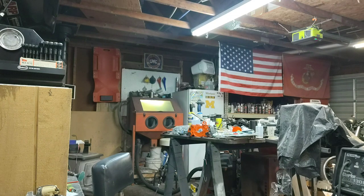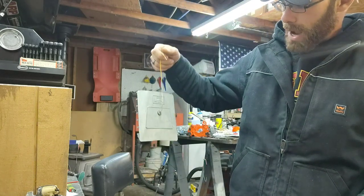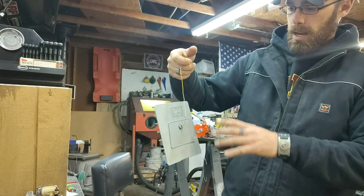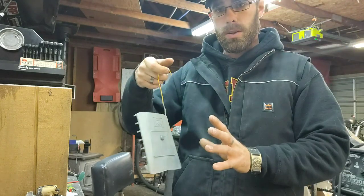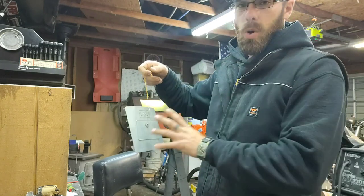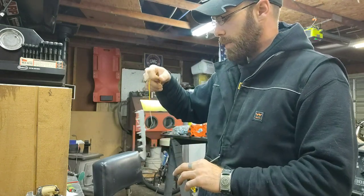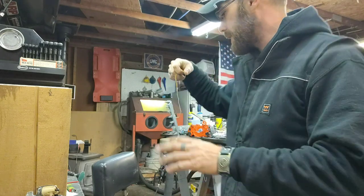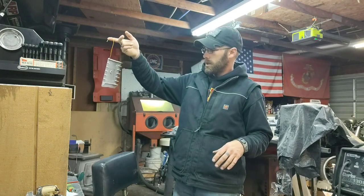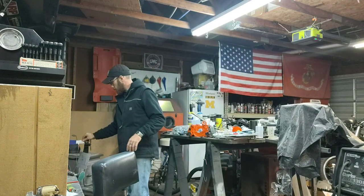Alright, I got the part here. It's been cleaned. I heat treated this previously when I was on the phone. I need to just spray it. I already went through, cleaned this, re-blasted everything, and stripped all the powder coating off from our little mistake. Being the old part, I should have automatically gone straight to preheating this, but I didn't — got a little antsy, got ahead of myself. So now all we need to do is put some powder on there and put it in the oven. It's only about 10 minutes in the oven so it won't take too long.